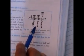This resistance box has a range from one to one thousand ohms, with all resistances connected in series internally. When two resistances are selected, both are activated and the resultant resistance is obtained by adding both. For example, when we pick 200 and 100, the total resistance activated will be 300 ohms.